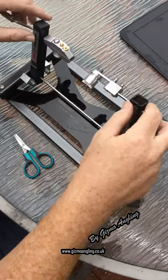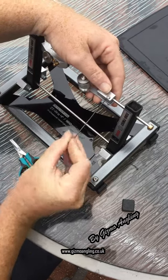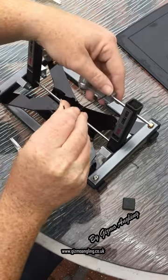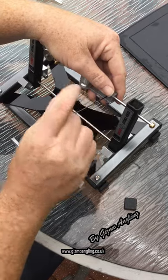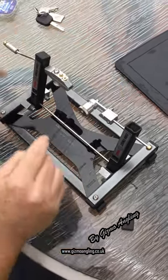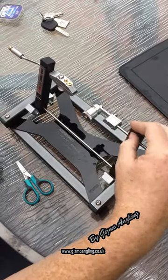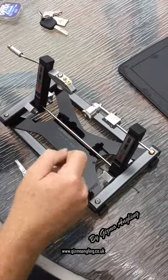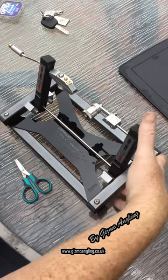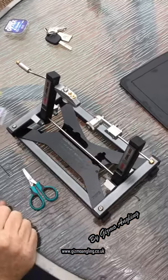You'll find that that's not quite aligned. What I find is it's easier to just line it up — just undo that grub screw. It's easier to line it up to make sure that they're level. It might take you two or three attempts to get it dead right. Once it's right, it's right for four, six, twelve. Push that in and then you're ready to go.